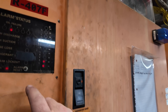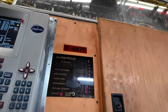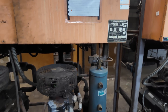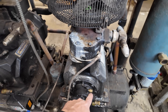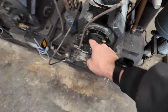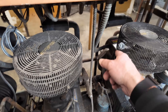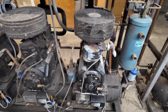Now, this thing here — let's hit alarm reset — this doesn't do anything, doesn't control anything. So it's reset and now it's running. Now let's see what our oil pressure is. We want to know what our net oil pressure is — what that means is the actual pressure coming out of our pump here minus our actual pressure in the crankcase. I'm not going to go to the crankcase; there's not a whole lot of difference between it unless that filter screen in the back is plugged.